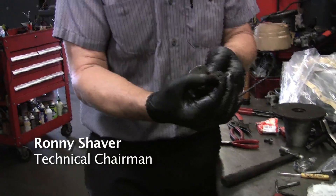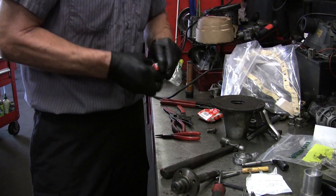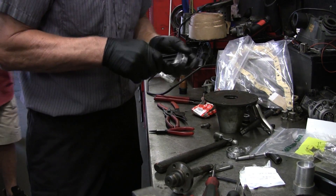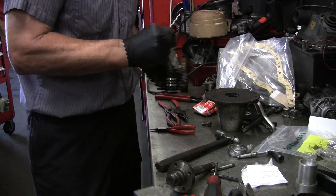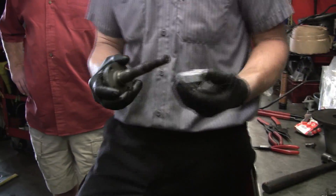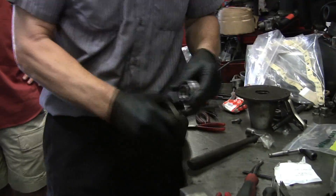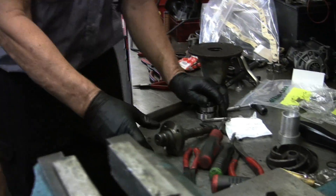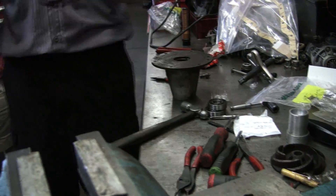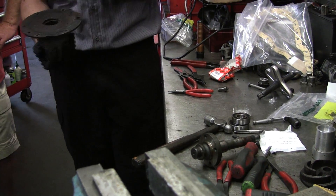What was holding that in? First of all, it's got a bunch of corrosion around here, so it goes into... So what it's fighting against is the corrosion. It's pressed on there. It has two size bearings — the big one on the outside where most of your force is from all those six belts riding against this. There's a snap ring on the front so we can take the bearings out the front, because we can't push that big bearing through this small hole.